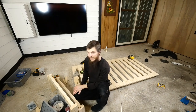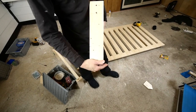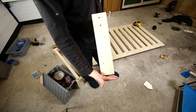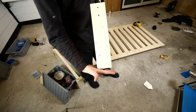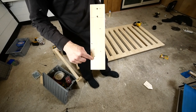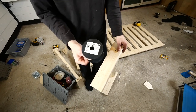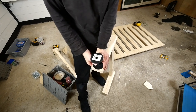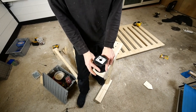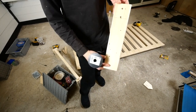I got those done and had a brainstorm. The problem I had with the other bed was that since the bed is at an angle and the leg is square to the bed, the leg ends up sitting slightly at an angle and the bottom doesn't touch the floor evenly. Felt pads are a little forgiving, but I wanted to fix that. My idea was to round the bottom so it would be sitting on a round spot. I happen to have this empty wire spool that's exactly three and a half inches wide, so I'm going to trace this circle and round the bottom of the feet so it'll sit on the floor nicely no matter what angle.